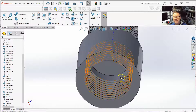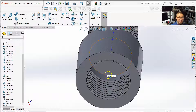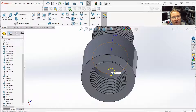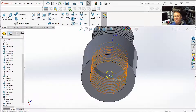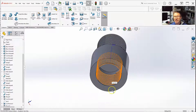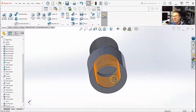The same thing applies to the internal — it's kind of harder to zip it. In reality, when you're tapping a hole, they do have bottom tapping tools that are flat on the end that can get almost all the way right up to the edge. But for the most part, usually when you're tapping a hole you're going to drill the hole at least a good portion deeper compared to the diameter. It also depends on the size — the smaller the tap, like M1, M2, M3, M4, M5, you have a little bit of a sharper tip. The bigger they are, you might have to go an extra 4 or 5 millimeters, and then you're going to have basically no threads because you just can't get that deep. So take that into account when you're actually designing — if you're going to do a tapped hole in reality, you want to make sure the hole is deeper than the actual amount of threads that you want.